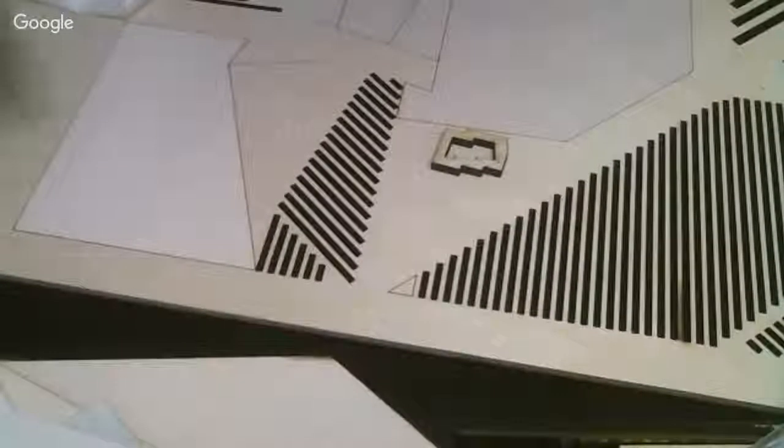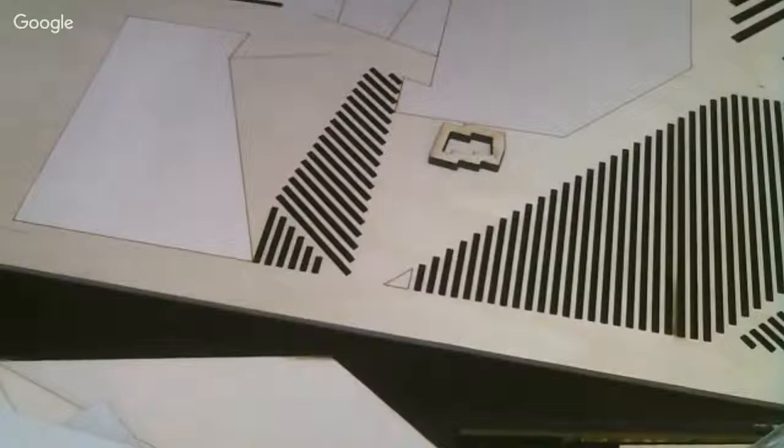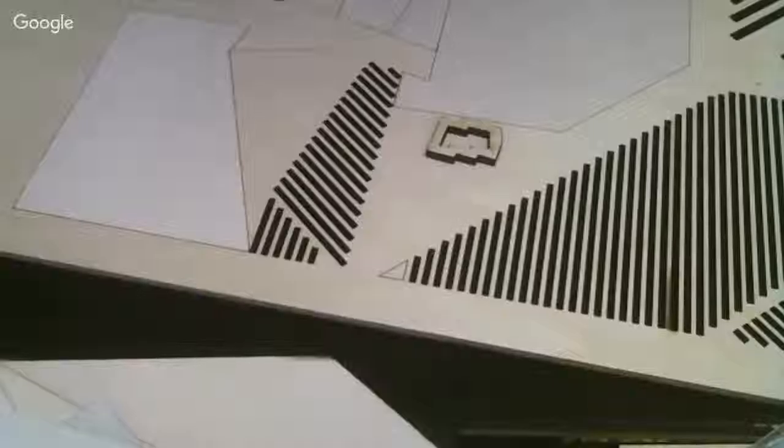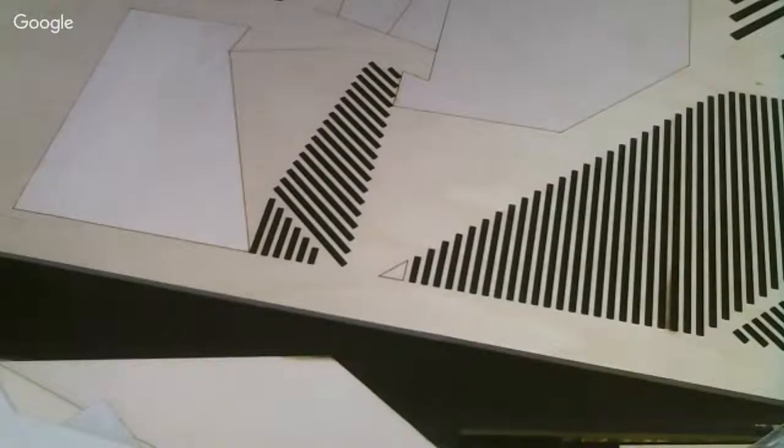Part of that was me and my AutoCAD — I'm the one who actually drew the lines. The laser did all the easy work; I just followed the instructions — these are the lines, this is what you're going to cut. What Bart was explaining to me was that sometimes you have an idea to put something in an eighth-inch or quarter-inch hole, but if the material is not actually that thickness, you're going to run into issues because it's not going to be a perfect fit. Each piece is going to have different issues of does it fit or not.